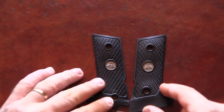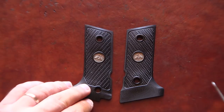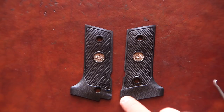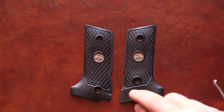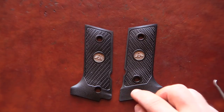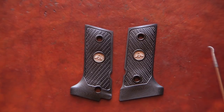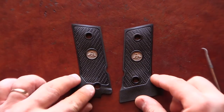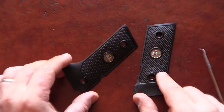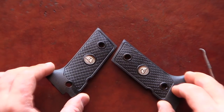The only problem is that with G10 grips, when they were CNC machined or milled, I imagine a small bullnose end mill was used and many passes were made — so this actually leaves a rough texture on the grip that I can't replicate. With this file I'm creating a smoother texture, but as you can hopefully see from your screens, it actually doesn't look all that bad — a little smoother, but still not bad.